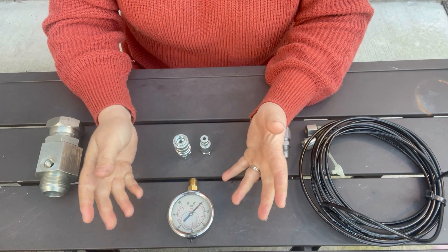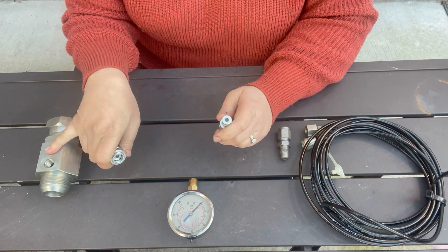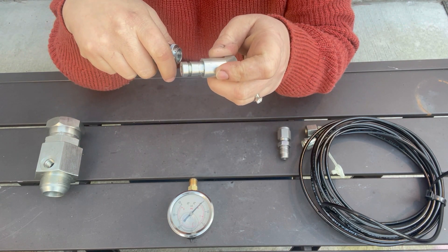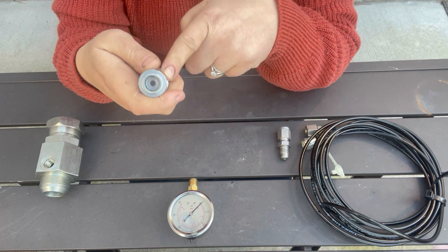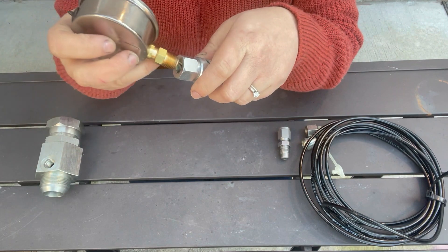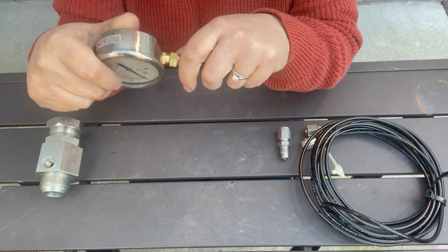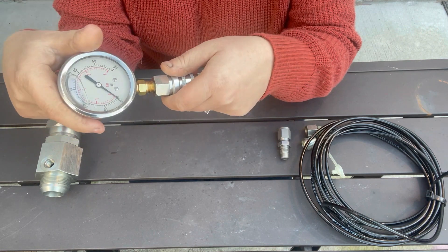If everything on your machine is going slow and you think the pump might be going bad, there are two ways to test that. Most pumps have a quick coupling coming off of them called a PD style, and you would need the female end of that to just pop together. They make a bunch of different ends for porting applications, but this one is quarter inch pipe. You can make up a five foot hose if it's awkward to get underneath the machine, or you can just screw the gauge right into the end of that quick coupling.